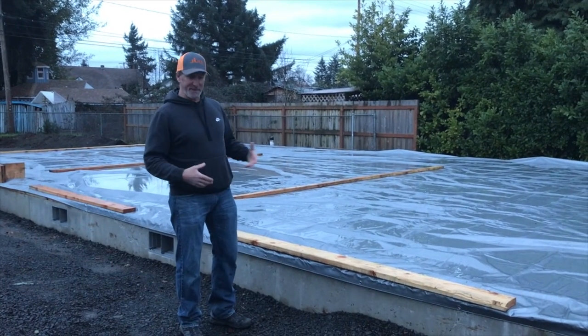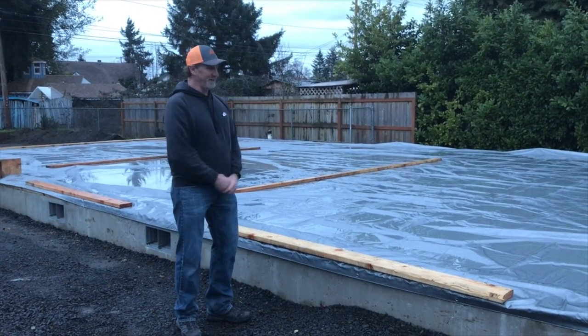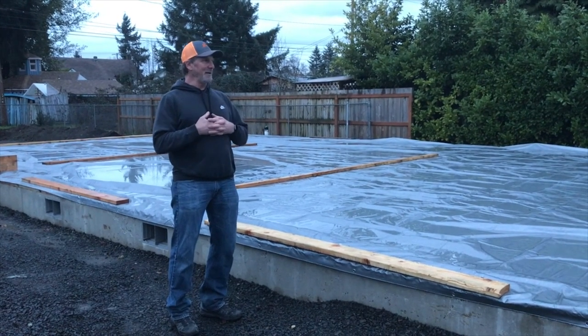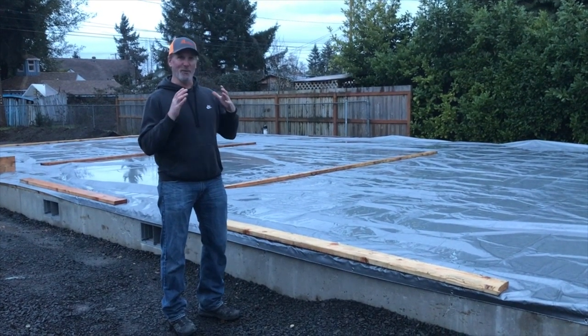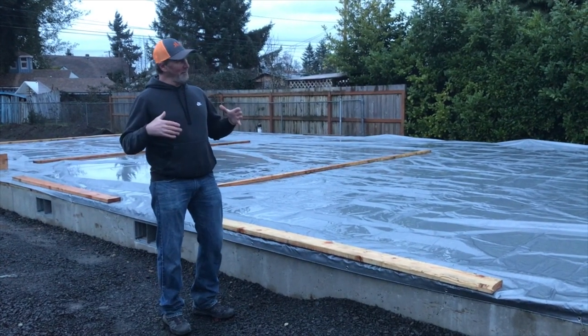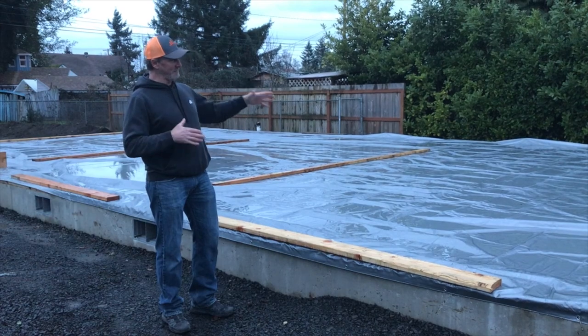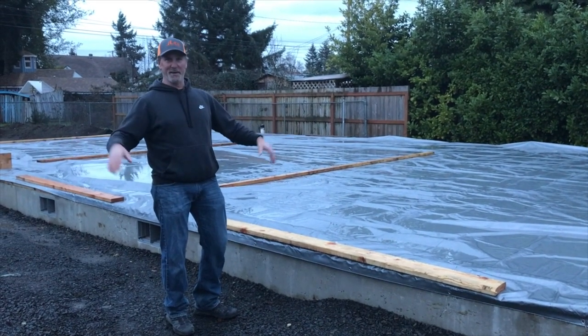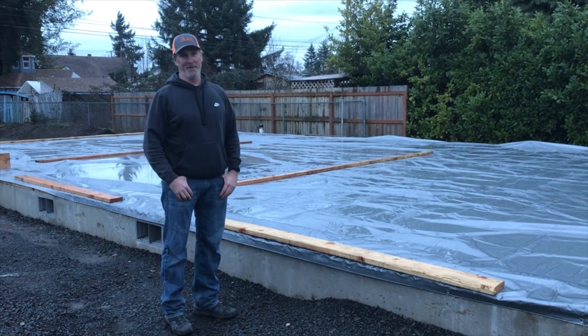Some people can't stand it. They've got this empty canvas, remember, and they feel like they need to make it look like something happened, so they want to get a wall framed and get it stood up or whatever. I propose that it's better to spend the extra time to lay every wall out and know all about what's going to happen before you even begin.